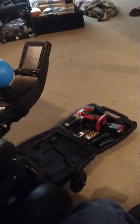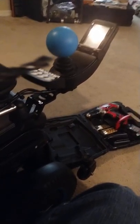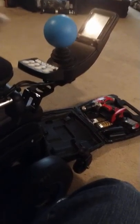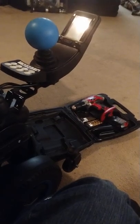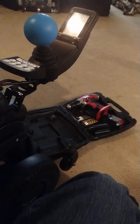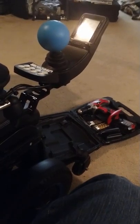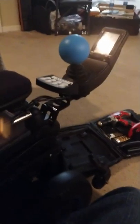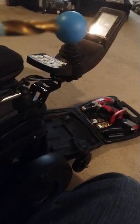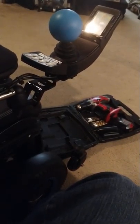Thank you very much. I do want to re-emphasize: it is very important that you start off by using the brad point drill bit on either ball, because if you use a split point bit it will walk no matter what. And it is very important that you stay very straight with it, so start off with the brad point.